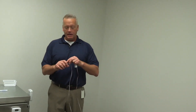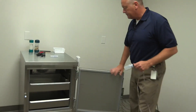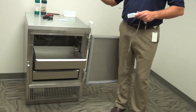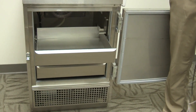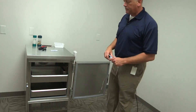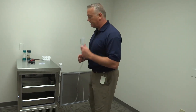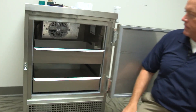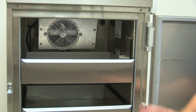Once we've placed our devices on the refrigerator, next we're going to put our probe and thermal buffer inside the refrigerator itself. Typically, you'll get this packaged as one piece with the probe and thermal buffer together. There are many different types of refrigerators — some with pull-out shelves like this, some with glass shelves, grated shelves — but you can put these devices in any of them. We're going to show this one with a typical shelf that pulls in and out. The first thing is to locate the cooling element or fan in this refrigerator. You can see it's right on the top here — that's an area we want to avoid for the probe and glycol bottle.